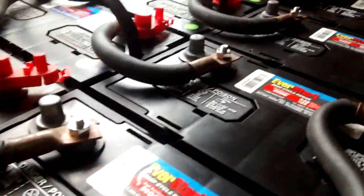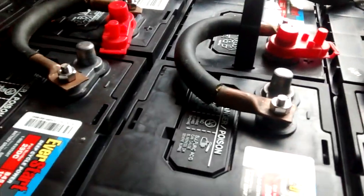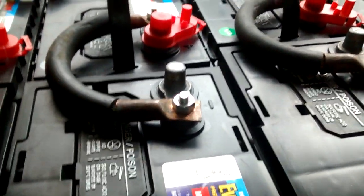I figured I might as well use them, did the math, and figured I'd have about 20 deep cycle 12-volt batteries wired up for 24 volts. When I say 24 volts, I mean 28 volts — it's just the range. Some people say 28 volts, some say 24 volts. It's the same range and the same idea.